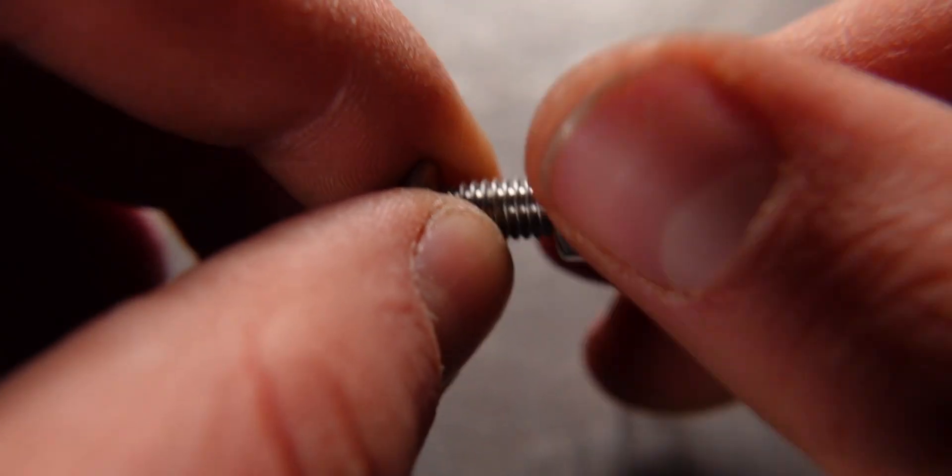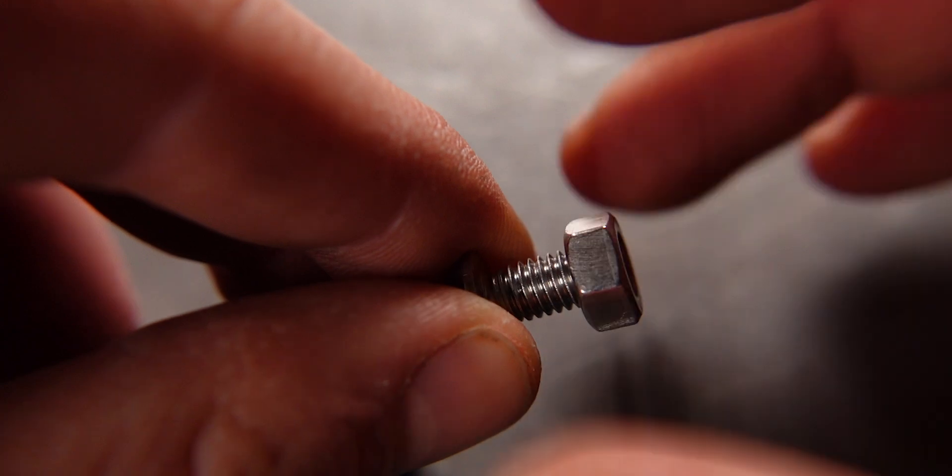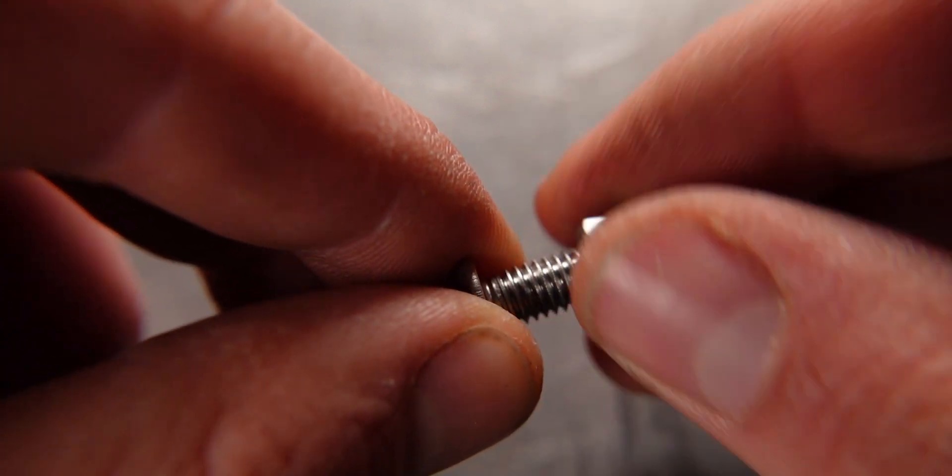Once you've shortened the screw, take the nut back off and look for little imperfections that you can then remove either with a hand file or with the belt grinder. That way you can make sure you have a nice looking screw with a good start to the thread. Works both ways like a charm. Thanks Stuart for the tip.